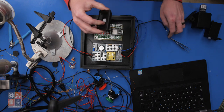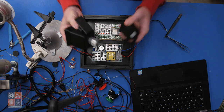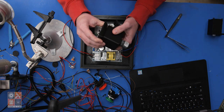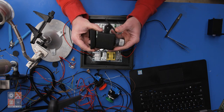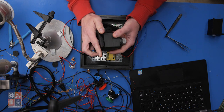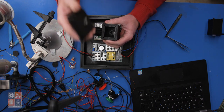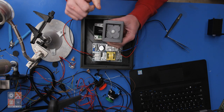Now, I 3D printed the enclosures for the PIR sensors, as well as the main electronics, mostly just for fun, no particular reason. Now, the outside PIR sensor will be outside, and the enclosure is printed in PLA, which isn't the best for that, but I'm going to paint it and just see what happens. If any water or whatever gets in, the most it will hurt is the PIR sensor, which is $6. On the cover, I'll put some silicone around it before closing it up with the screws.